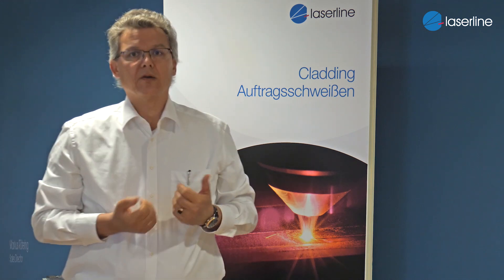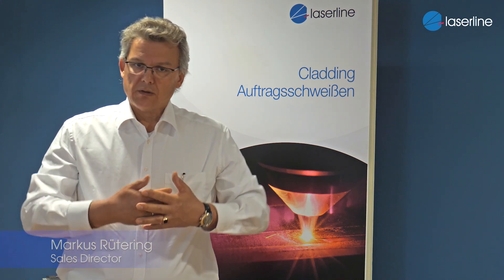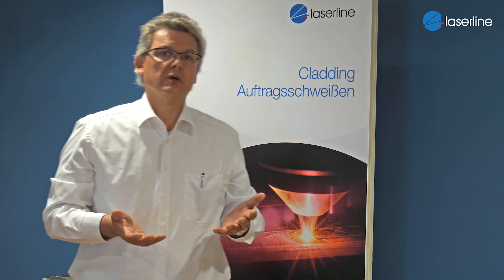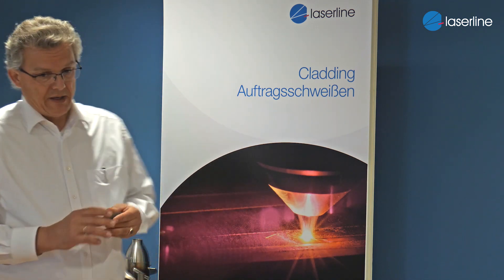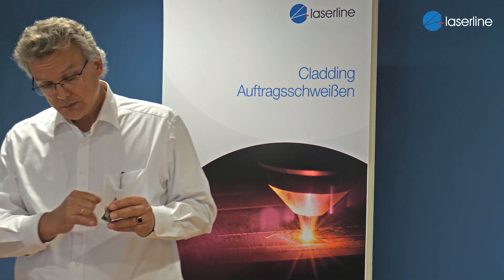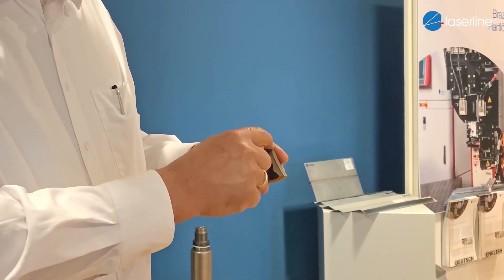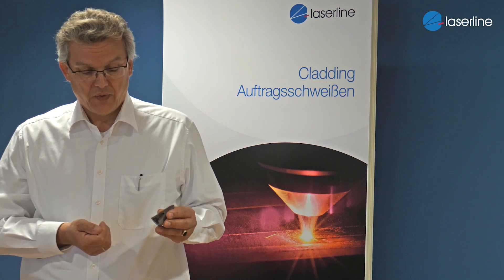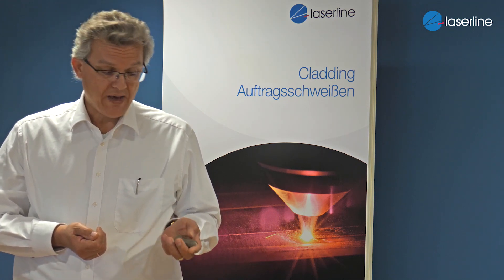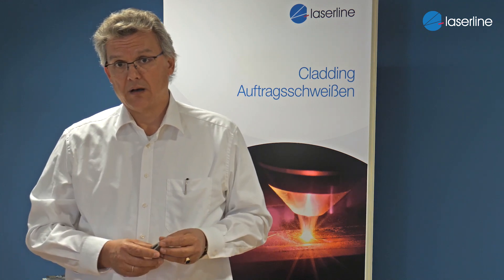The fourth section I mentioned was repair welding. This means we are talking about a part that has been manufactured for a certain purpose, has been used, is worn, and has pieces broken out — and we have to repair it. Very typically we talk about big moulds from the automotive industry, though I don't have such an example here. As a demonstrator, we have a simple part where we have added a second layer from powder to bring it back to its original geometry — repairing the part rather than making it completely new.